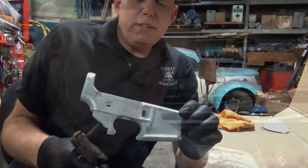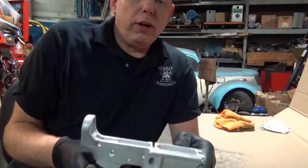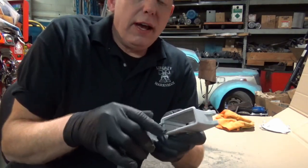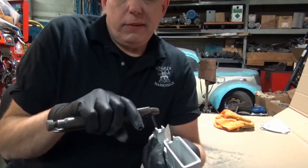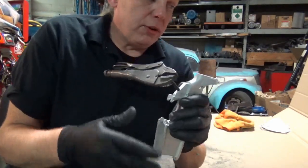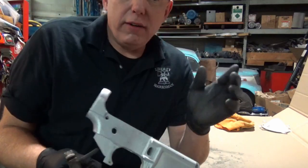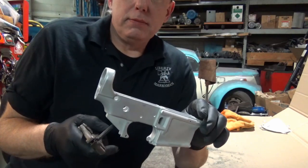The little pieces really suck. Now is the time, if you have a finished lower and you want to do any work on your magwell — flare it a little or smooth it out — obviously do that before any coating or finish work. Because if you start sanding it out afterward to get that quick mag change, you're just going to expose raw aluminum. This is another option you can do at home: no sandblaster, no oven, no compressor. Straight up just labor and a can of paint.